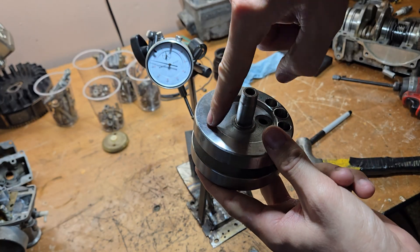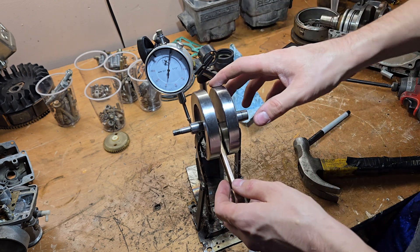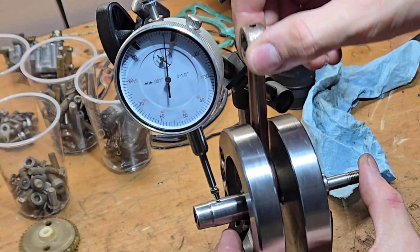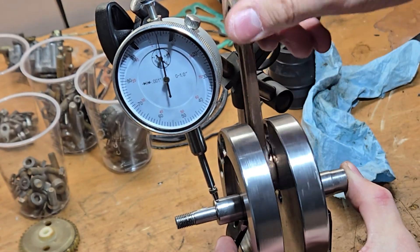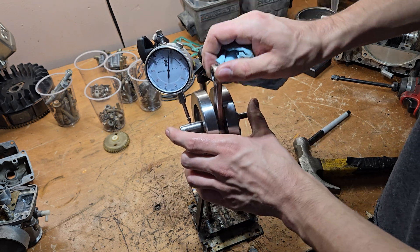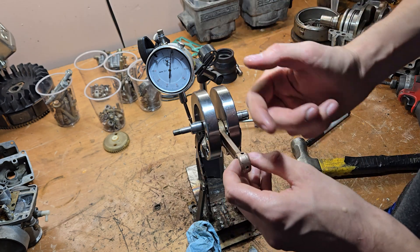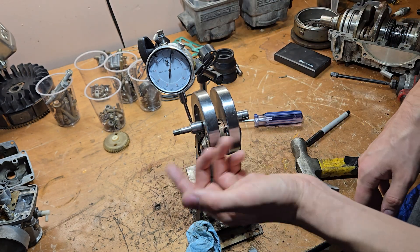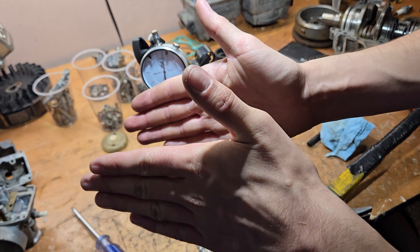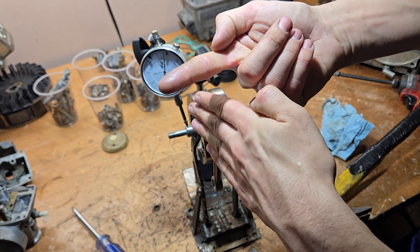So now this is the other side — yeah, you see that? I went too far. I'm going to press on it like this. It's back now. It's pretty easy to go too far with just a little bit of force. What about this side? This side is basically perfect — it's like maybe half a thousandth of an inch. Now we have to deal with this: the rod is facing this way and there's a highest point right there. So this shaft is slanted this way with the rod this way. The ribs are actually skewed a little bit.